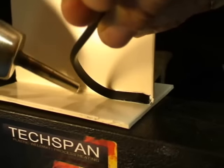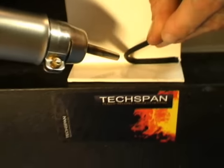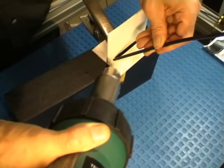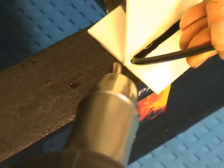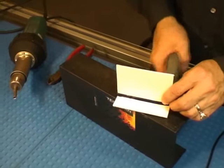The pendulum welding technique is used for short welds, repairs, or when access is difficult. The standard pendulum welding nozzle is fitted, and a pendulum action provides correct, even heating to both the welding rod and the parent material.